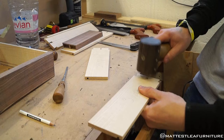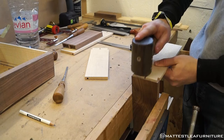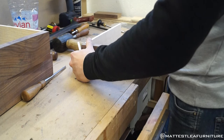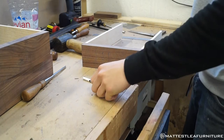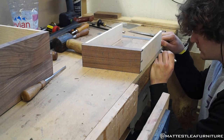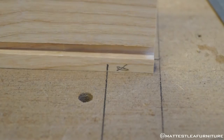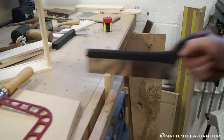With the two angled drawer fronts on either side of the cabinet, it's difficult to get the sides cut square at the back. What I was doing there was marking the angle of the drawer fronts onto my table, then assembling the front and the sides so I can line the front up with that angle on the workbench. I mark a small line on the back to the point where I want it to start being cut square, then square that line across and mark it on the opposite component — so they're perfectly square at the back but still angled at the front.